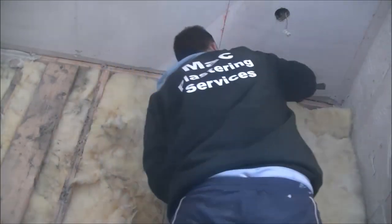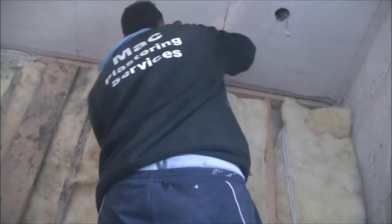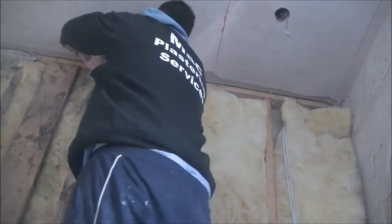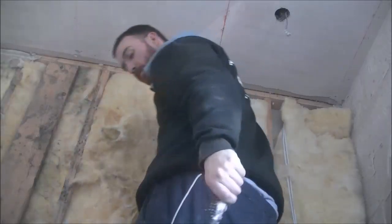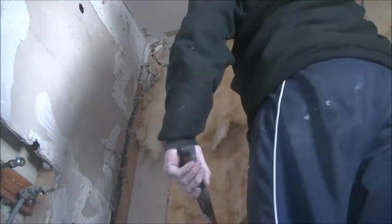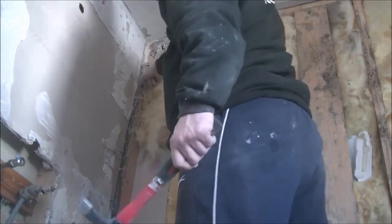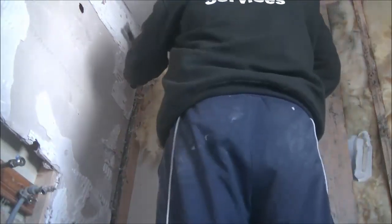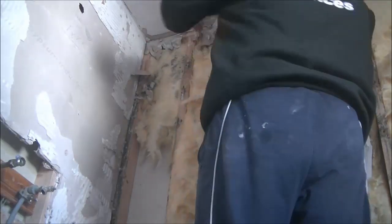Preparation is key to every great job. You can see here I'm taking out all the old nails that didn't come out when these old boards were ripped off the timbers. Like I said, you don't want to leave them in — it'll throw your board off level and make finishing an absolute nightmare, and can bust the whole face of the board. I'm also using the chipping hammer to take off the excess edges from the knife, to cut the scrim if needed.